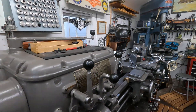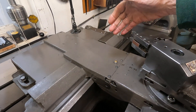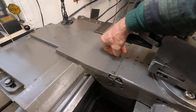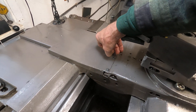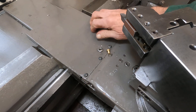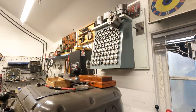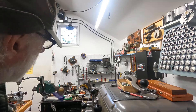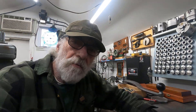That's how you make these things last. Over here on the Axelson — they didn't make very many of these early ones and they did a lot of changes — I wasn't sure if oil was definitely getting to the cross feed screw, so I made the same kind of thing there with a brass cap into the tin cover. I learned from a guy named Bill that it's kind of good to oil things.